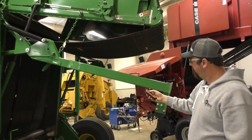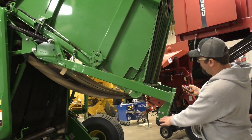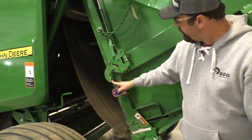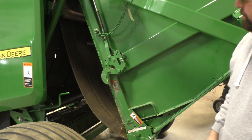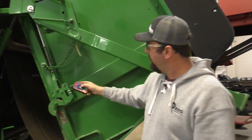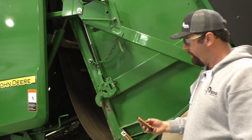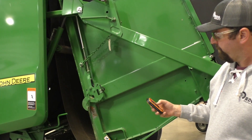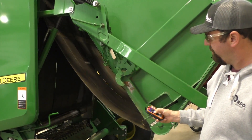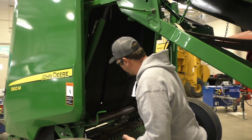Our kicker is hanging out as we close it down — it's going to hang there and keep our bale away. Our cast iron hooks, our chain door hooks, are going to be basically spring tensioned along to the hydraulic cylinder, much like the Vermeer. Those do break every once in a while — that's something to check if that door alarm keeps popping. It could just be as simple as that. Inside our baler, with our door open, we're now safe to come in.